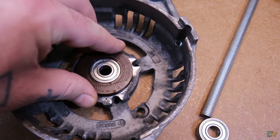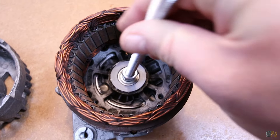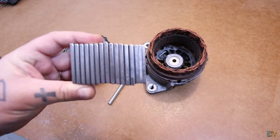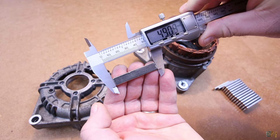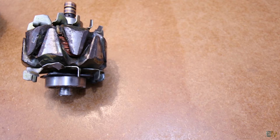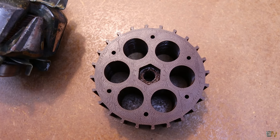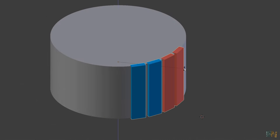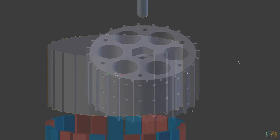I've made a few measurements. Since I had to cut the old shaft, I will make another one using a 10mm threaded rod — that way I can add my own pulley and connect it to the induction motor for the future experiment. I cut the threaded rod to size, around 17cm long. I now measure the bearing holes. I would use these smaller bearings because they are cheaper, and I designed a small plastic collar to go around it. The bearing fits inside and this entire part fits inside the car alternator frame, then I can add a shaft on these bearings.